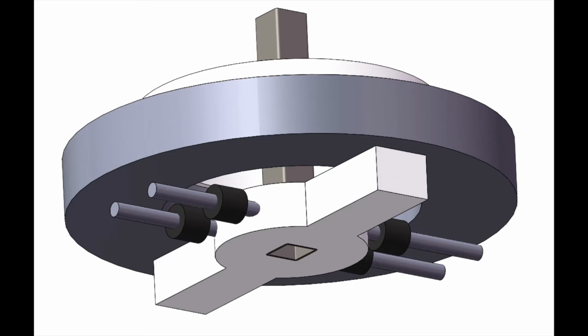The sudden release of water from our siphon integrates well with the components that we are receiving from our client. And the components that we're receiving from our client are the things that are actually tracking the sun, and they integrate in our design as our system moves up and down a central pole. The central pole is a square pole, and in our design for our lower plate, we have a square cutout so that our system slides up and down that central pole nicely without twisting and turning. Also attached to that lower plate are rollers.